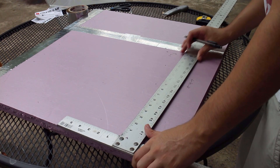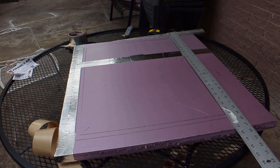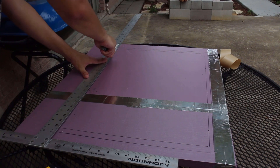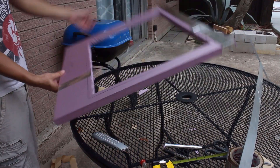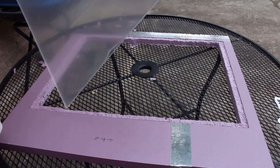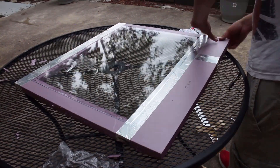Given that I wanted to add a window, I got the idea to carve out the foam and do some type of insert. We started by getting one of our acrylic pieces and placing it relative to where we wanted our window to be. After marking down our corners, we took the tape measure and measured a square half an inch smaller than the acrylic. You're going to want to cut the inner square from the front and back side depending on the length of your blade, and pop it out. To give the acrylic a sturdier fit and more flush look, carve out that border to the thickness of the acrylic — just make sure not to go in too deep. You should have a result looking something like this, and now's a good time to test fit the piece of plastic in the groove. If everything fits, take off the plastic protective cover from the acrylic pane and lay it in the groove. Using aluminum tape, seal off the edges where the foam meets the plastic to hold the window in place and prevent heat from escaping.